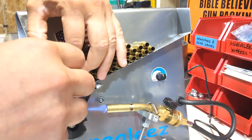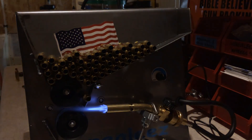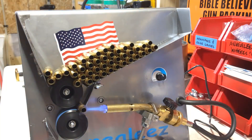Now this is where I pull the trap door out and start annealing my actual brass. I'm going to lower the light again. Almost perfect — I need to slow it down just a little bit. It's hard to show on the camera, but the neck just starts to glow as it drops out of the flame. You don't need to adjust the speed control that much off the test brass. I'm going to turn the light back on now that I have everything set, and I can just let the Anneal-EZ Gen 2 do its thing.